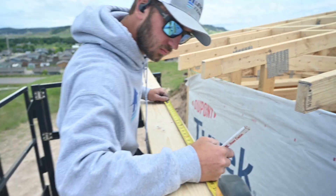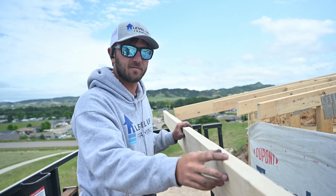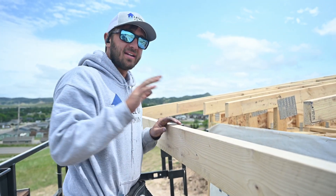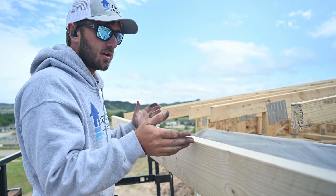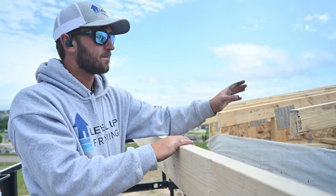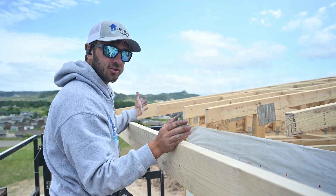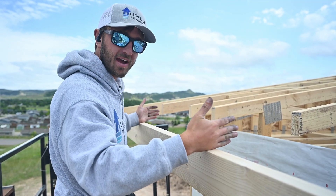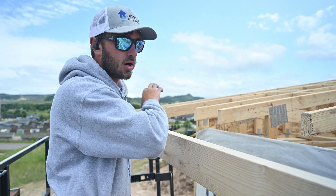Then these are just two foot on center the rest of the way. I've got my marks all the way out to eight foot, which is the center of this 16-foot two by six. I'll hold this up and nail this mark directly on this tail — that should straighten our sub fascia on the end, but you have to go back and make sure it's straight and fix it with your eyeball. The reason we put these marks here, especially at the beginning of a run, is so that when we go to sheet, all of these tails land where they're supposed to. Around the seven or eight foot mark the sheeting is going to split this tail, so we want to know we can split this tail right where it needs to go.